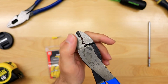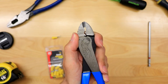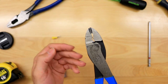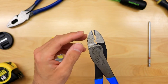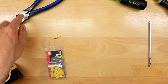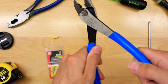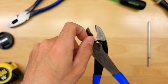If you are doing seismic work — living in a place where earthquakes can happen — you will be doing a lot of seismic work when it comes to lights, exit signs, and things that can fall. Very often it will be non-insulated crimps, similar to the crimp on your pliers, but the workflow advantage is that these crimp from the front. You don't have to open them up, wrap around the wire, or line it up. You just slide them in and boom.